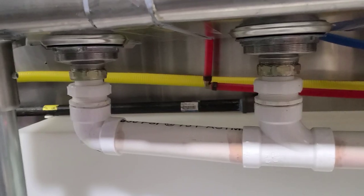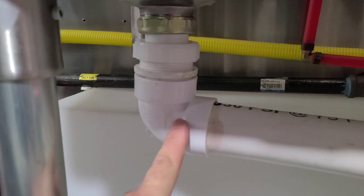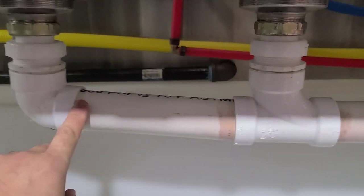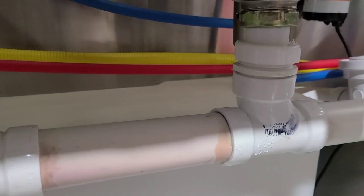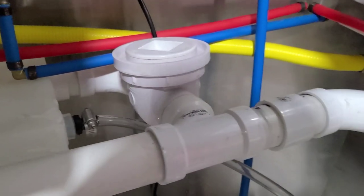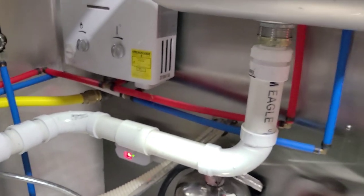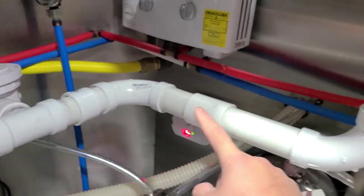Let me show you on my food truck so you can get a good visual. You can see the difference — this 90-degree elbow is a lot sharper than the one I purchased. It has the same trap adapter going into the 90-degree elbow, then a one-and-a-half-inch PVC piece, which connects into the backflow preventer — that's what prevents water from splashing back. Then it gets connected to the hand sink. I think we should go back and work on this truck now.